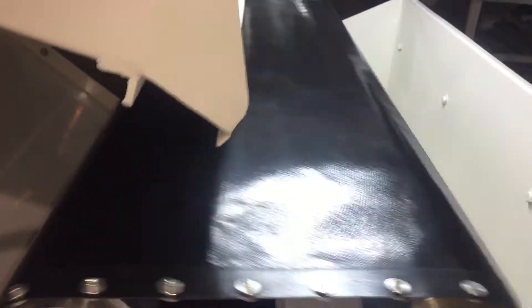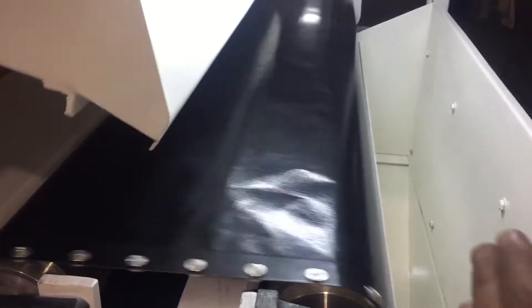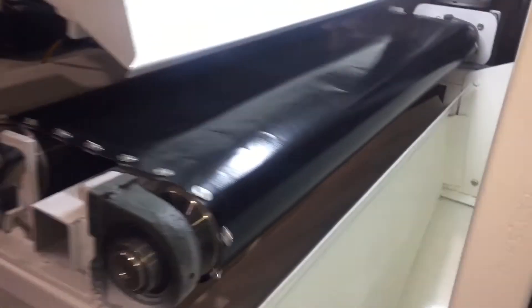Materials fall onto these magnetic conveyor belts, which are Teflon-based. We have two rolls in the belt — one is a magnetic roll and another is an idler roll. Whenever the materials fall down to the belt, the remaining magnetic content drops into one outlet, and the non-magnetic content falls into another outlet at the front side.